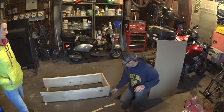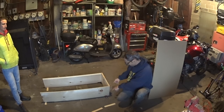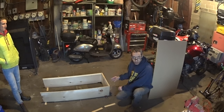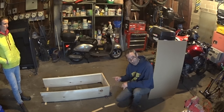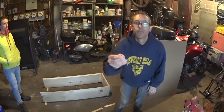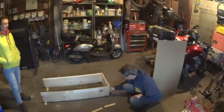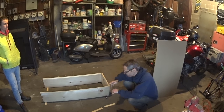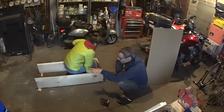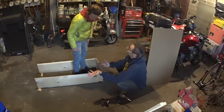So now I've got these square 90-degree angle brackets to hold the wood so we can glue it and screw it. First thing I've got to do is pre-drill the holes so the wood doesn't split when I put my screws in. I'm going to put three screws — one, two, and three. On the wood today we bought for the sides, the top, the front, we spent $53.